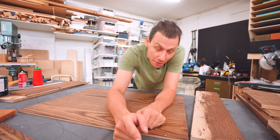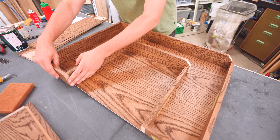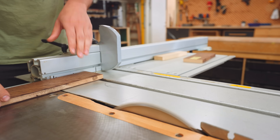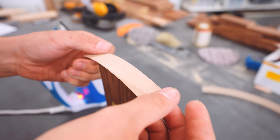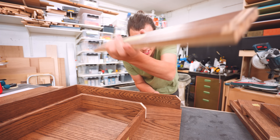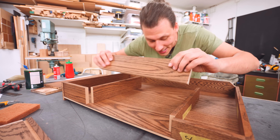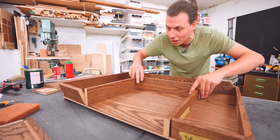Let's finish up these drawer parts. Starting with the one that has the most modifications — all the parts were sanded, edge-banded, and oiled the same way, so all I had to do was chop off various bits. I got lucky and reused test pieces from the oil testing. I cut down most pieces to a lower height, some needed chamfers and more edge-banding, and I recut the side piece by cutting off the bottom instead of the top and cutting a new groove. To avoid cutting new parts, I cut the back section into three pieces with a Japanese handsaw so the kerf would be really thin, then moved that piece forward and we're good.